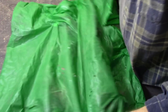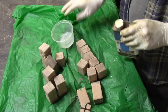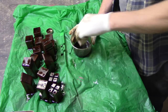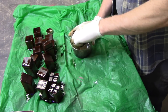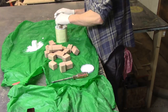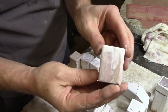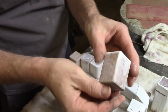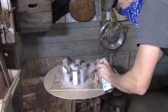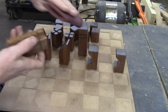Here's where I really screwed up, and I will save you some trouble. The idea was to use walnut-tinted Danish oil on the dark side, and then on the teak I wanted to use a pickling white — a water-based white stain. I thought that would give it a wood grain look but just lighten it a little bit because there wasn't enough contrast between the two woods natural. But you can see it just looks horrible. So I ended up sanding it all out and spray-painting the teak white. I know it's like a real sin to spray-paint teak, but I pulled it out of a dumpster, so I can do whatever I want with it.